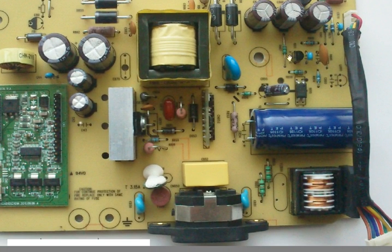There's also a feedback circuit here. This is an optocoupler, and that's probably a TL431. This takes a sample of the output voltage and feeds it back to the PWM chip, so the chip knows what the load is and can increase or decrease the pulse width modulation to control how much power is required.